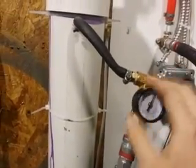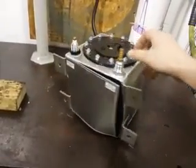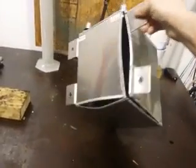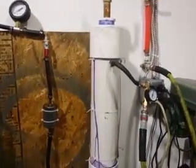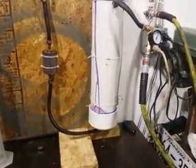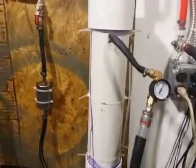The air comes from the regulator up to the pressure vessel that I built. The previous one I built didn't fare so well — I tried to use an aluminum fuel cell for a race car, a little dragster, but once I got up to 20 PSI, it exploded. So I went with this guy instead. This PVC is actually rated at 240 PSI, which is well over what I need and gives a good margin of safety.